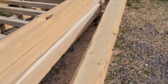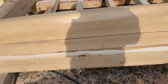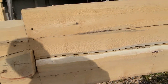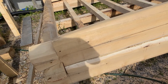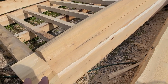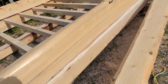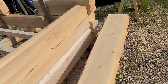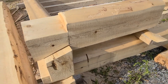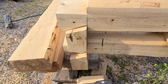I didn't get much on the logs done. This one bottom log is a lot lighter, so it was touching right in here. What I did is I cut the gap with the chainsaw and then dressed it back up. I've fitted the joints better — everything's still just moving around. Obviously I don't want to lock this in yet. On the final setup at the log cabin site, I'm not sure if I'm going to drill these in with timber lock screws or how I'm going to do that yet.